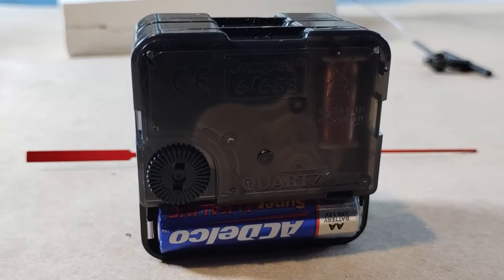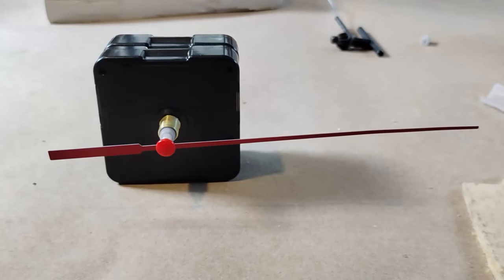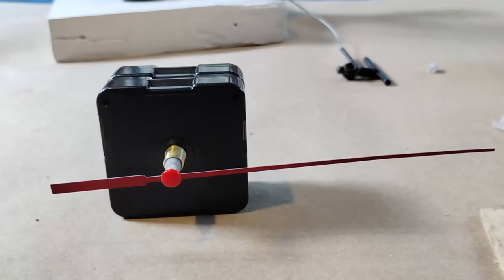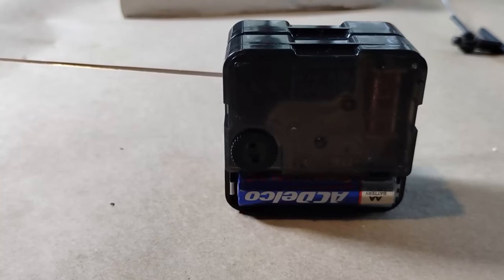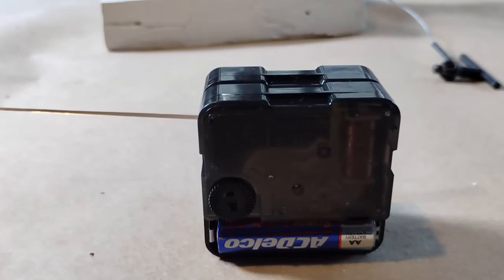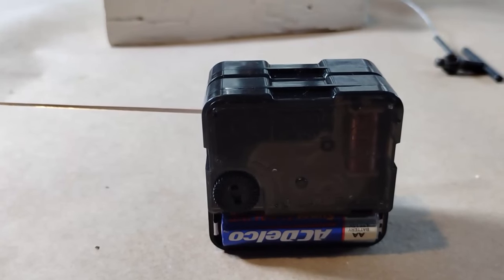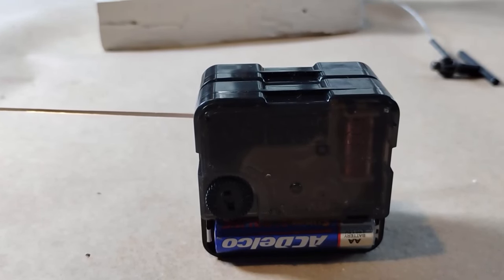If it works for a while and then stops, try pulling out the gears of the driver movement, cleaning them, and then putting them back in place — a piece of plastic may have gotten between the gears. If the second-hand gear will not stay upright but instead flops over as you move it, it may be because the glue bond inside has broken — take it apart and attempt to glue again. If when you spin the wheel on the back it moves but with great difficulty, it may be because the hour-hand gear is too long. Either take it apart, undo your glue bond, and cut it down and re-glue; or if you can get it apart without breaking the glue bond, put two or three layers of double-sided tape to make up the difference, then reassemble. If these solutions do not help, leave a comment down below explaining your situation and we'll help you get it sorted out.